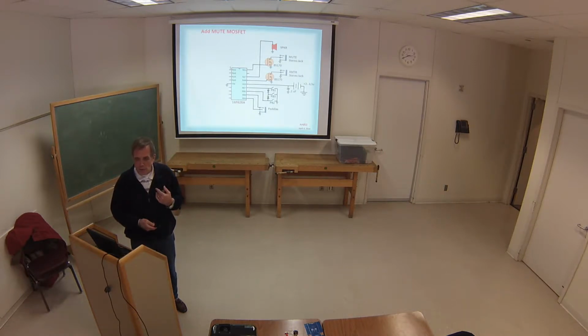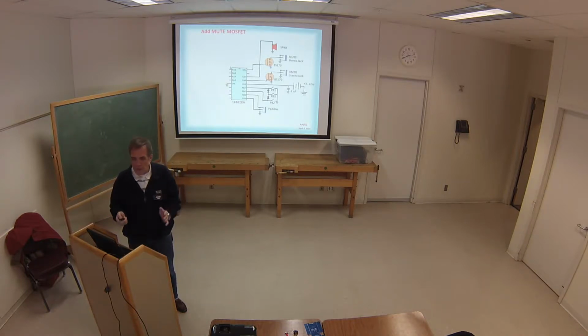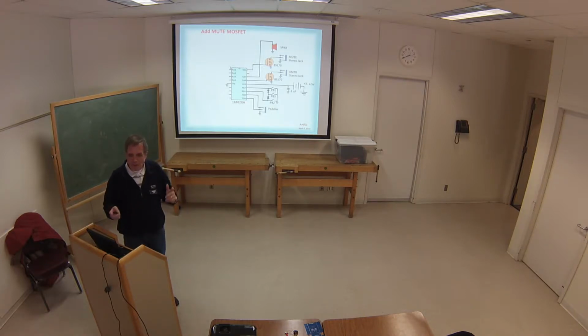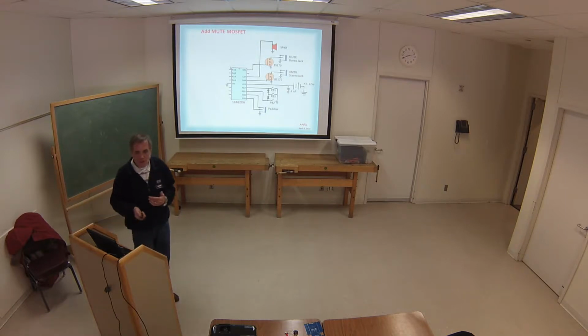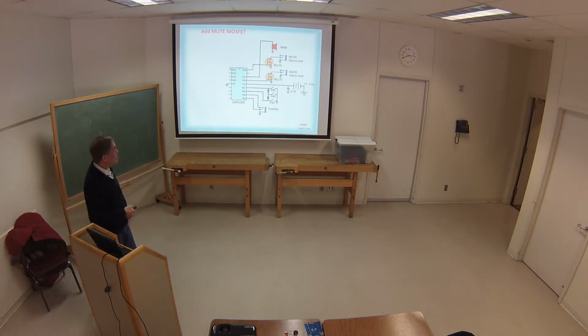Now my thought always was to put that in the rig. That belongs in the rig, but he said there are enough people with standalone transmitters and receivers who would like that function. So we put it in there and changed the keyer code to do that. I did some circuit analysis of the timing waveforms to see how much it really distorted the pure mathematics of it, and it was a little bit. Percentage-wise, 7 milliseconds is a bigger hunk of it when you go at 55 words a minute, but it's not too bad at the lower normal speeds, so it's hardly noticeable. So it is there, available for those that want to use it. So there we have the first version of the keyer.